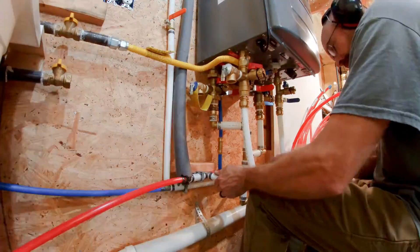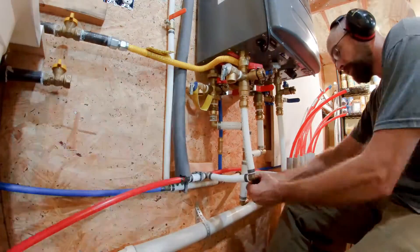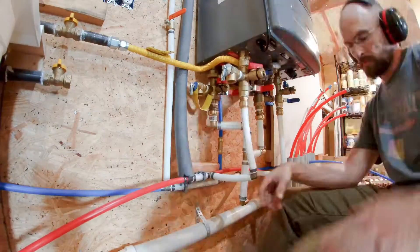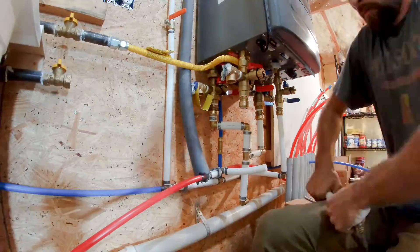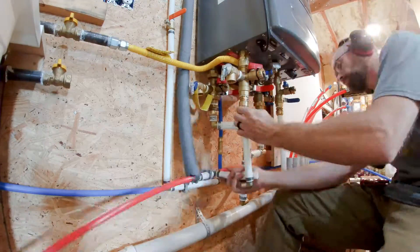Here I have to adjust the depth of the pipe — I need to cut off the copper crimp ring. You can do so with a pair of wire cutters or a small hacksaw and pair of pliers. You can really see here how the SharkBite fittings have an advantage when I have to modify things.